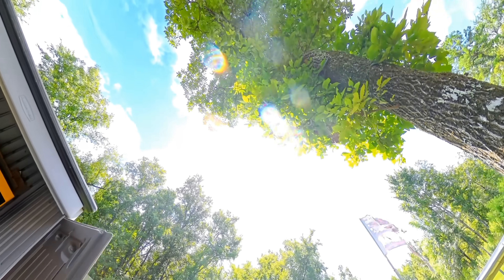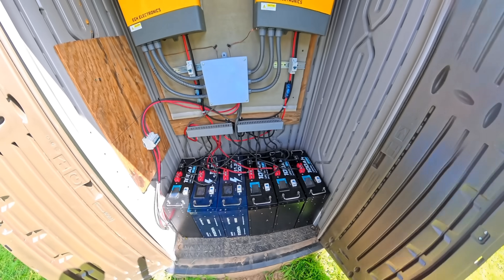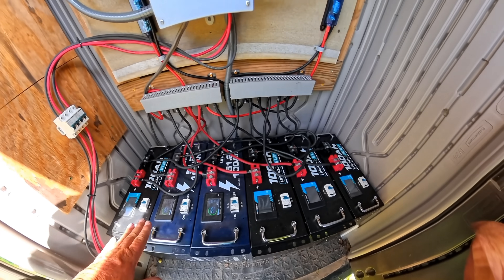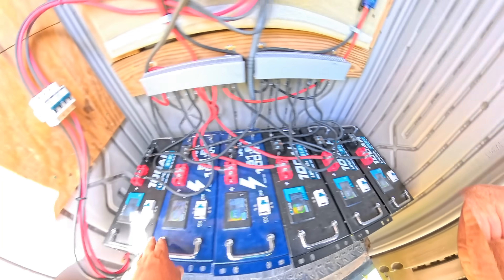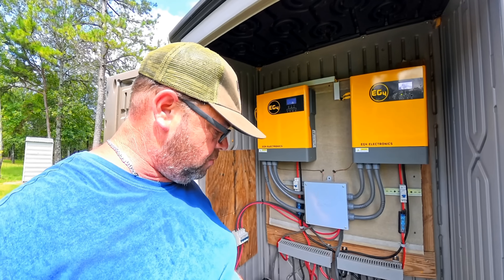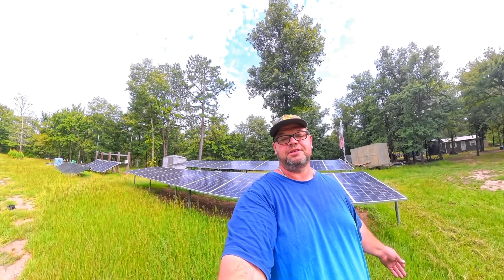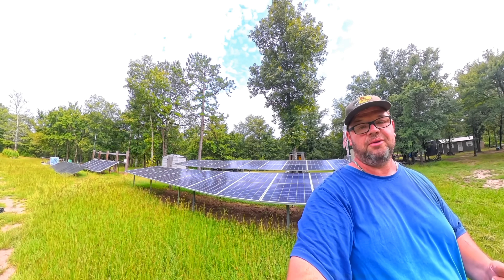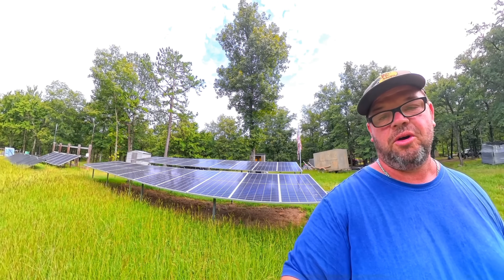The sun finally came out and we're already up to 62% on the batteries — 65, 63, 61, 60 percent. I'm seeing around 3,000 watts on each inverter, which means my panels are pushing around 6,000 watts total. If you'd like to build a system like this I'll leave links in the description for the batteries, the solar panels, the inverters, T-class fuses, wiring, and accessories so you can click on them and see what the total cost will be.